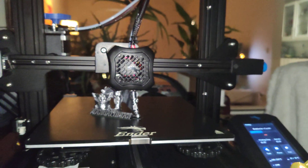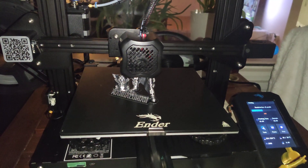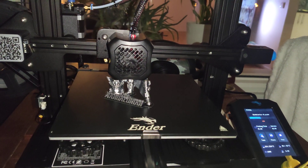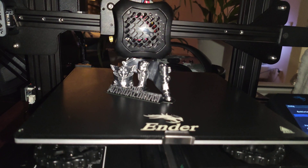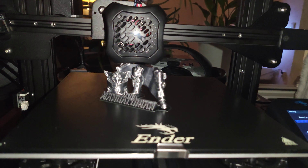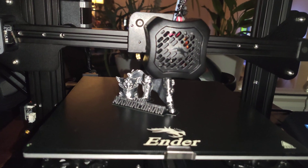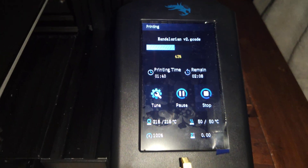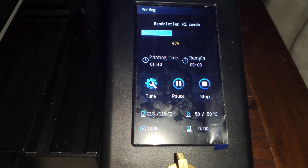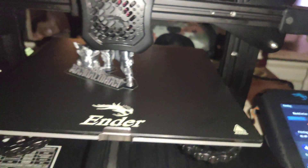Link below so you can download. I'm using an Ender 3 V2 printer and I'm very happy with the result. I'm printing at 55 or 60 millimeters per second, 0.2 layer height, and using silk filament. Printing at 200 to almost 220 degrees with the bed at 50 degrees.